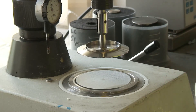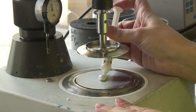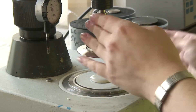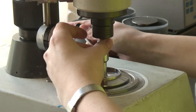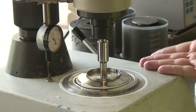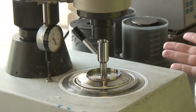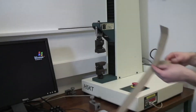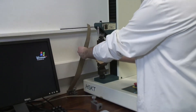We apply a set amount of the adhesive and the plate then heats it for us. As we lower this, we like to spin it slightly so we get an even spread of the adhesive. This is obviously the slower speed. It then begins to run at faster speeds later on and this simulates different pouring conditions, different ways that the glue might be applied in an industrial situation.